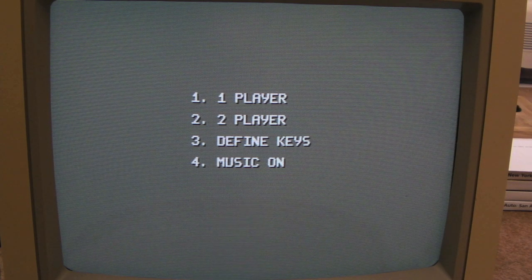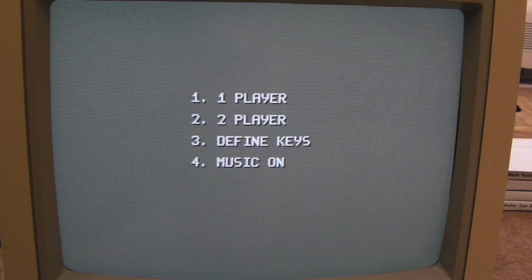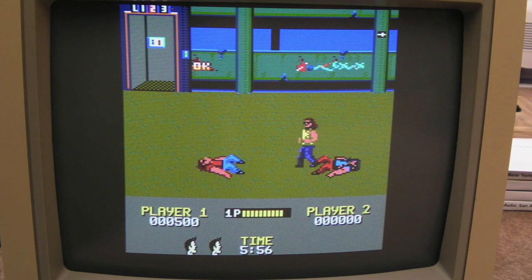I might need to play with the settings on the back of the monitor because the picture's not quite right. The picture's a bit better now — sweet. We can test out that additional memory: if we load Robocop we should get speech samples when we've got 128k, and it's the same thing with Chase HQ from what Novabug said in his video — that should have samples too when we load it. That's a good way to test if we've got the additional RAM working. I can't test anything beyond 128k as I'm not sure which demos make use of more than that.